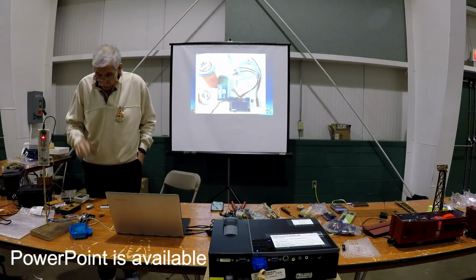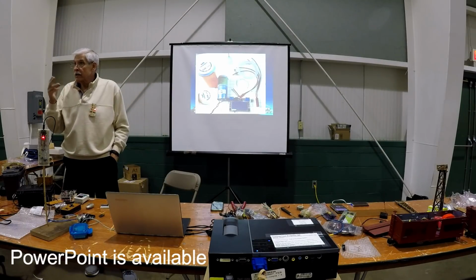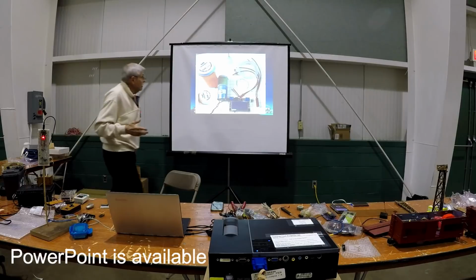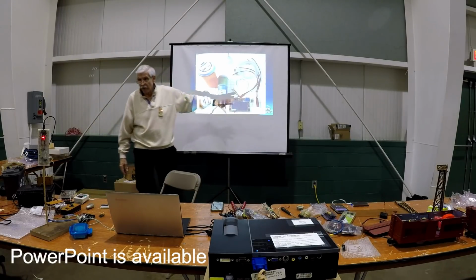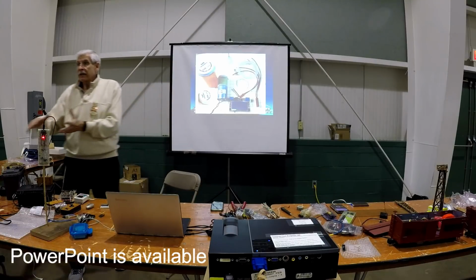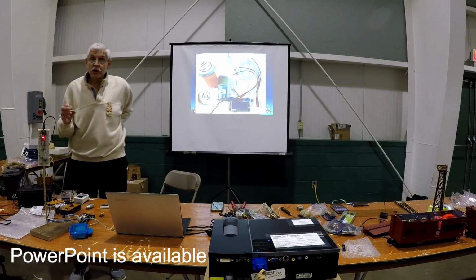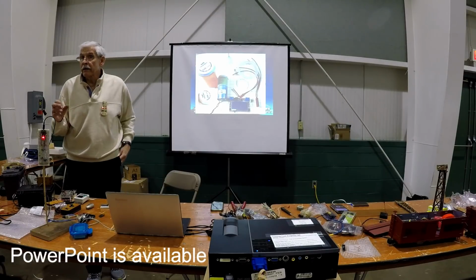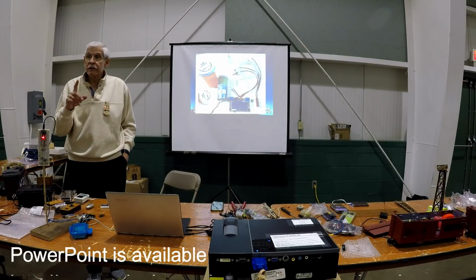You don't want to run these things on much more than 3 or 4 volts because that's all they're getting in the e-cigarette that people are using. If you run them on 5 or 10 volts, you're going to burn it out. So this little adapter, and these are, I don't know, $5, $8, will take 12 volts or whatever you want to give it and take it down to 3.7. You need a decent amount of amperage. Now, you certainly could run it on AA batteries, like 3 AA batteries, but I don't know how long they would last. Okay, questions?